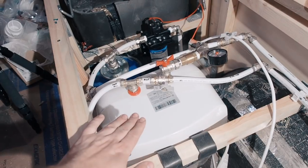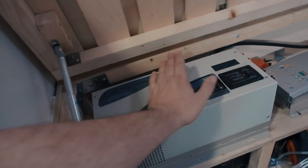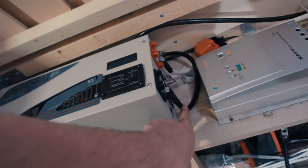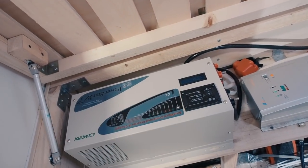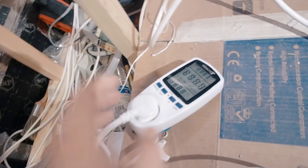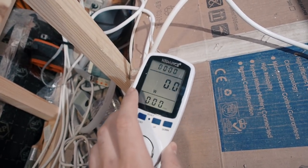It's an Ariston 10 liter AC water heater with 1.2 kilowatts of power consumption. It's AC, so I need to use my DC-AC inverter to connect it. I connect this inverter with huge 50 square millimeter wires, or 0 AWG if you use that kind of system, and it should be enough. My battery is somewhat charged, so I will turn the power on, and I will also connect my heater through this power meter